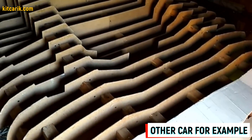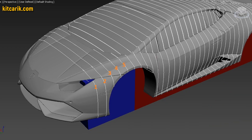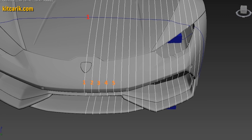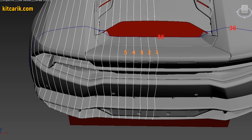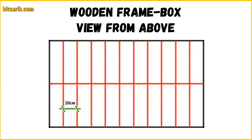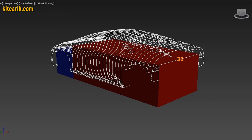Fiberboard sections are ready. To be honest, the previous stages were a bit boring — we were doing appliqué like children. But from this moment begins the most interesting part: car buck assembly — it's like Lego, but for men. Before we begin assembly, we need to make a frame box on which we will collect the car buck sections. Specifically for each car we make a universal box, and the box size is included with the drawings, along with detailed instructions on how to draw landmark lines on the surface.